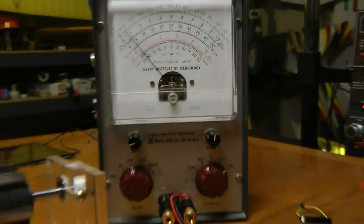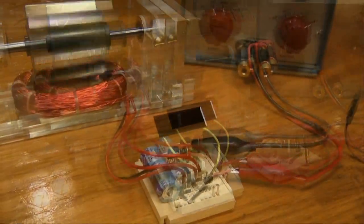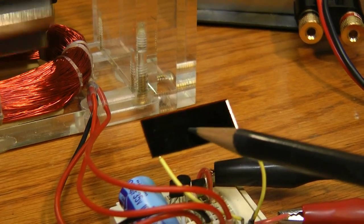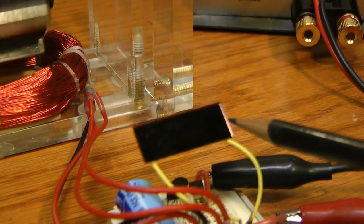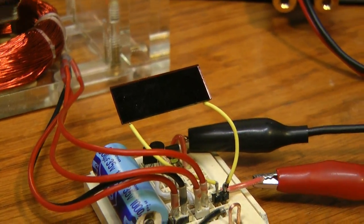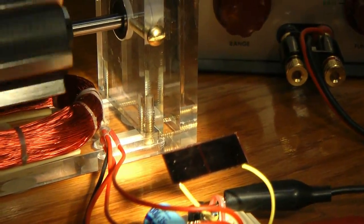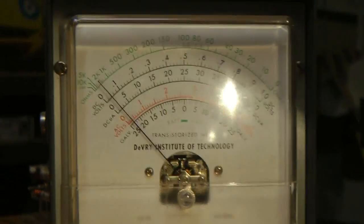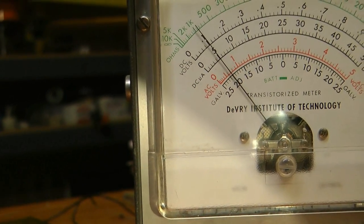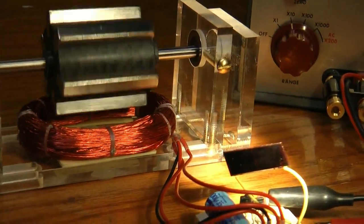So now it's actually running from the fluorescent light above me at 40 micro-amps, which is pretty good. Now here's a little guy — really tiny, probably only three-eighths of an inch by maybe an inch and a quarter long. This is from a dollar toy, and it certainly is worth a dollar to get the solar cell out of it. It needs a little help so I'm putting a flashlight on it. You can see as I move the light across the cell the meter jumps up to over 50 micro-amps. In the sun it would easily stay over 50 micro-amps with this small cell.